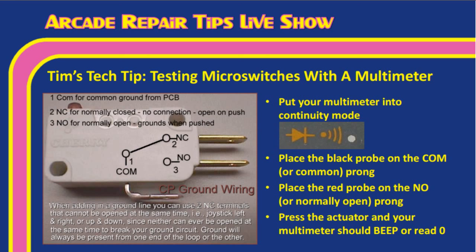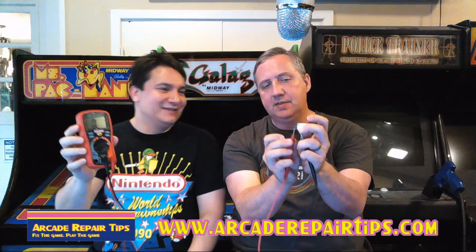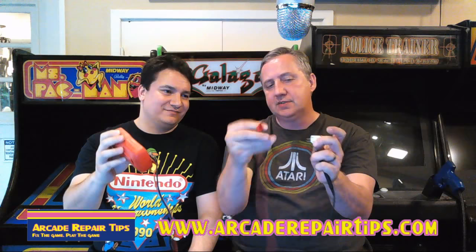So here we go, Tim. Tim has got it all rigged up. Now, sometimes it takes four hands for this, right? Yeah, I'm pretty skilled. So I've got my black lead on there, and every time I hit that, it's going to beep. Now, what should it do, Jonathan, if I touch the top one, the normally closed? It should beep immediately, and then when you press it, it should turn off.